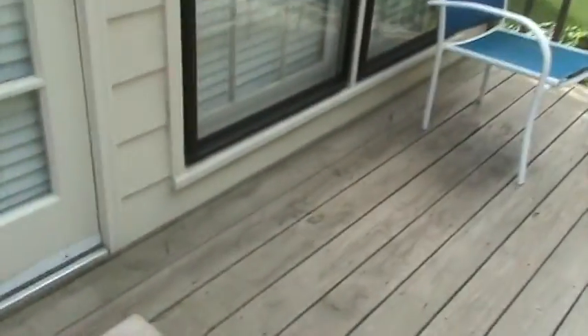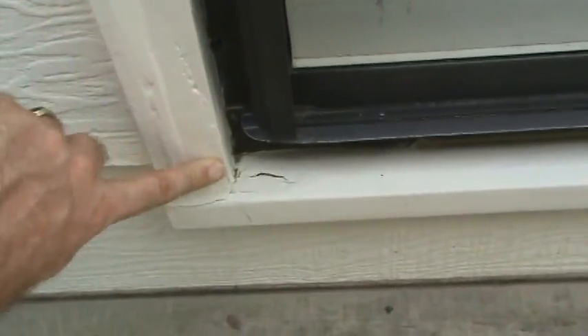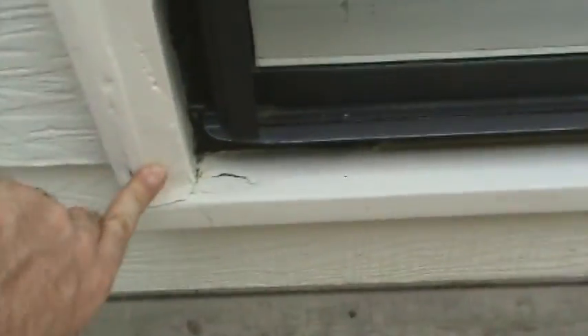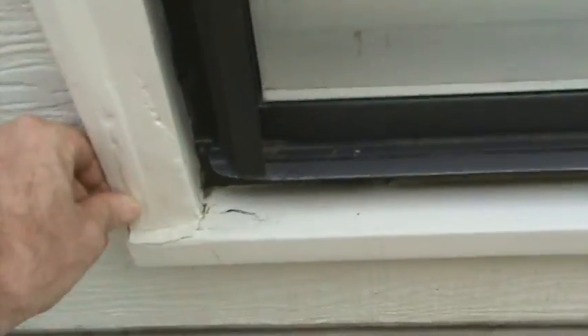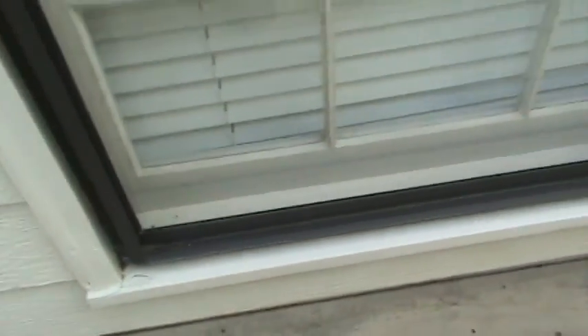You see the stuff that people do? They paid somebody to fix this railing — look at the railing. Welcome to Atlanta. You can see it a little bit better here — see how the siding gets really thick up in here, and there's mold and fungus underneath it. So we're replacing 14 pieces on this side, 13 on the other side. The face is fine. These windows are the same thing — to the left of the rear deck door, that brick mold is rotted out. Here's a repair done last year — see how they just bonded this over with putty.